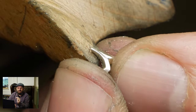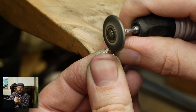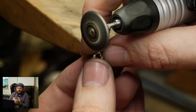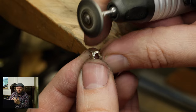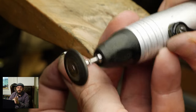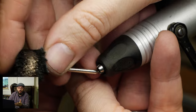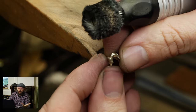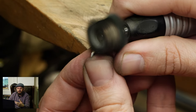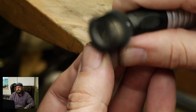It's quite relaxing and nice at this stage when it's in your hands and you think 'I've made that' and you're quite chuffed with it. This is a slightly knife-edged collet — using a knife-edge file just to put a little bit of shine in there to see what stage I'm at. This isn't aiming for a final polish — it's more just making sure those final lines kind of meet up. You don't need to take it much more than this because whatever you're making, a lot more of these cleaning processes can be done once it's all assembled. It's good to get into those little gaps before you put the stone in, obviously.